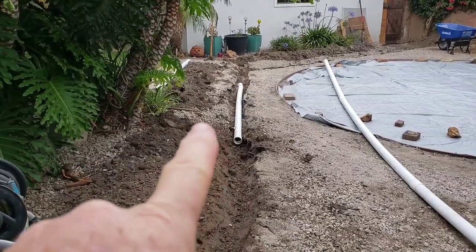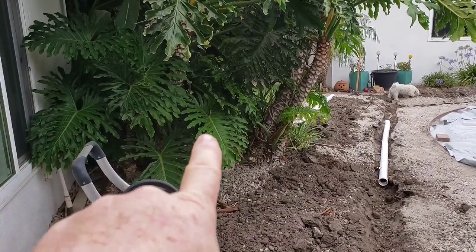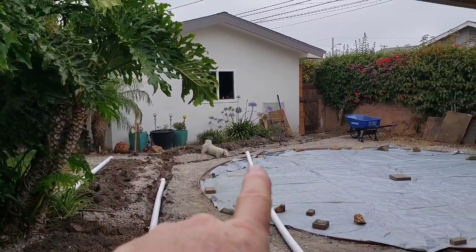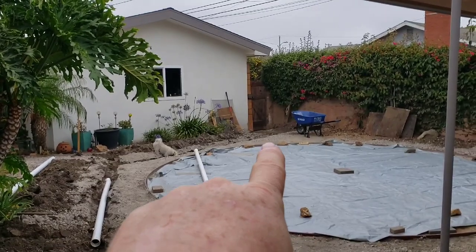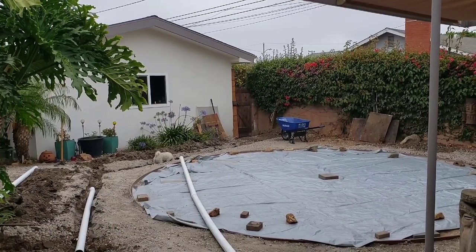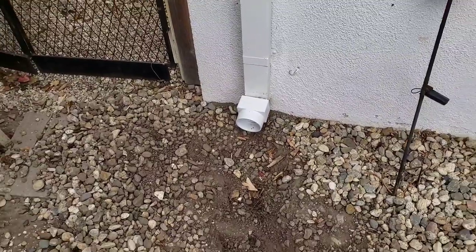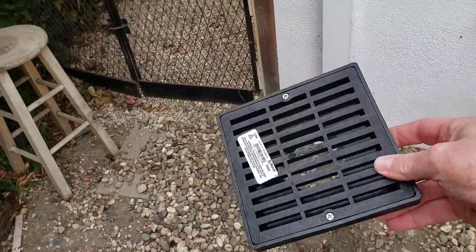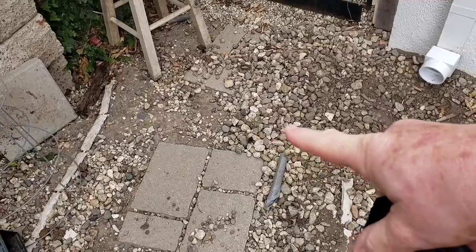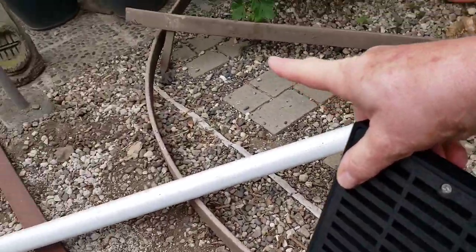What I'm going to do here is connect the downspout to this three-inch pipe. I'm also going to add an above-ground collection area right here in this rocky area near my patio, which also collects a lot of rainwater. I trenched down and I'm going to use a pop-up valve at the other end. For the downspout we're using one of these little removable grate downspouts, and I'll be putting it probably between a couple of these sunken pavers.